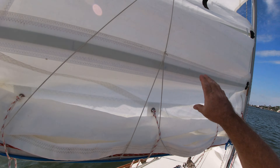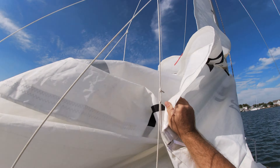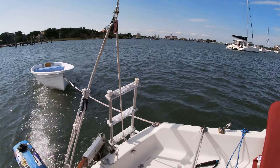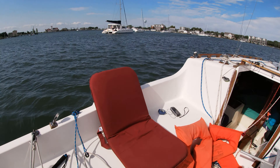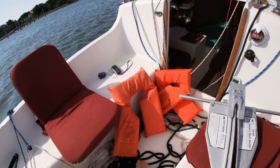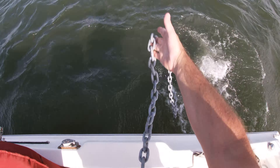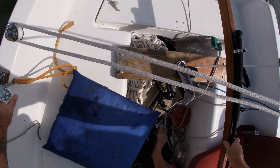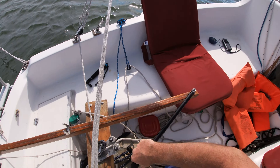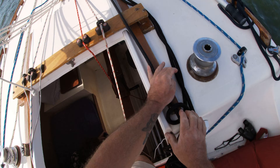Now I'm going to lower my sail as I motor in to my spot. I'm going to throttle down. I know the boat's going to fall off a little bit as I drop my hook. I'm going to lower it carefully into the water, making sure that I don't get snagged on my prop. I'm still just puttering, and I know I've got 50 feet out already, so now I'm going to let out a little more.